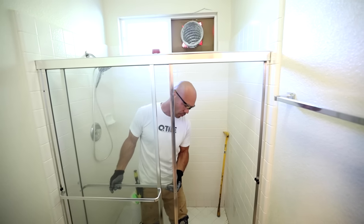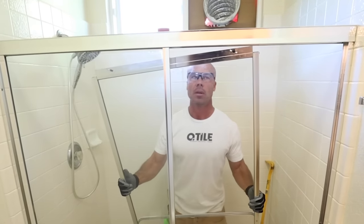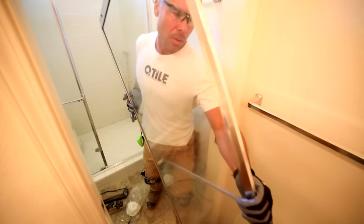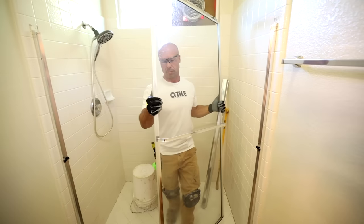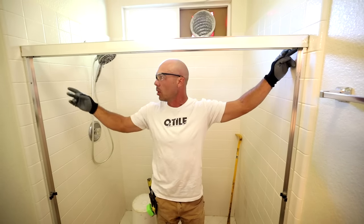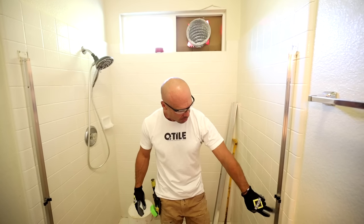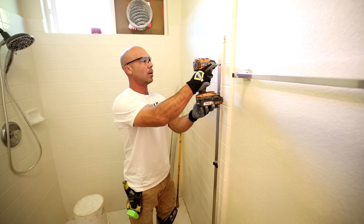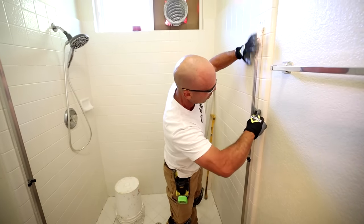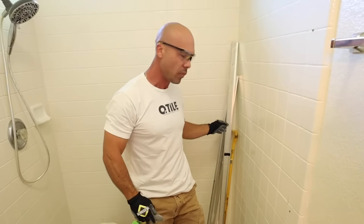The shower doors usually just lift up and out. These sliders usually just come up and out - this little truck is loose. You can usually just unhook the rollers just like you would a closet door. These headers on the slider doors sometimes have a little screw on the inside just to hold it in. Then we've got three screws - I'm just going to use my impact. These are always siliconed in too, so you usually have to cut the bead. Once you get it started, they'll peel the seal off. That's how the side rails come off.